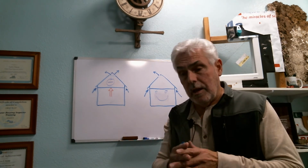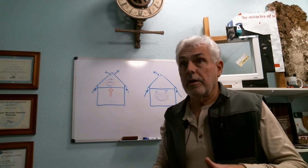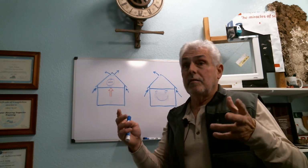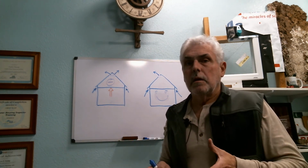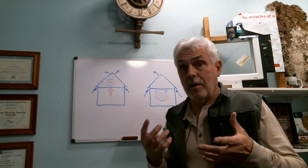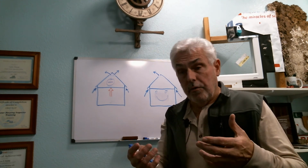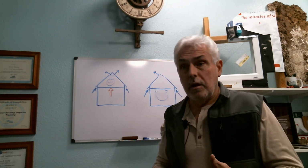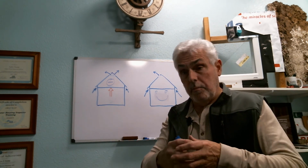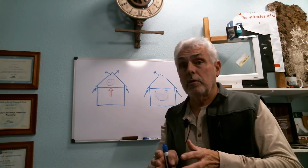But the point is that when you have an attic mold situation, again, to reiterate what I said last time, is it a health risk? Are people going to die and this and that? Probably not. I mean, everybody has sensitivities to things, but by and large, it's that huge encumbrance when you go to sell that house. So part of the remediation is treating at the discretion of the expert, but also trying to mitigate all these other factors that are putting more moisture load on the house.